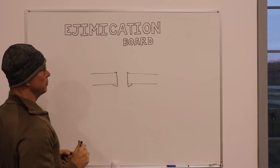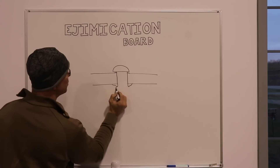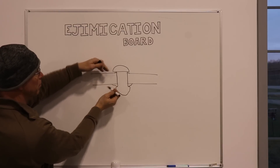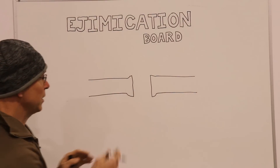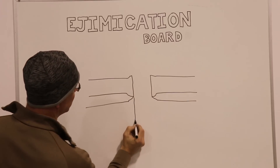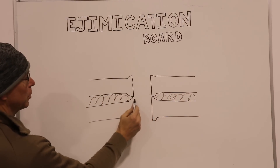So that's what we want to remove. If we wanted to put a rivet in, it's going to sit on that burr, and when we smash it, the rivet really isn't squeezed against the aluminum — it's just crushing the burr. Now if we have our sheet with the burr and we want to rivet it up against another piece of aluminum, those two sheets can't touch each other. There's a space between them because the burrs are in the way.